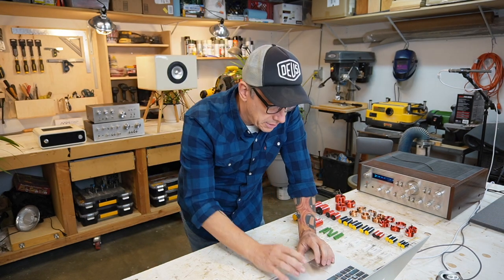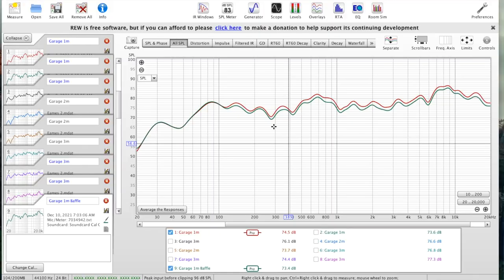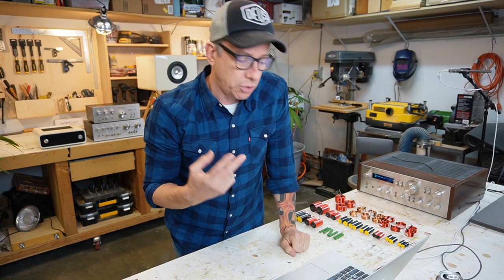We got our first curve. We lowered everything after like 100 hertz. I don't want it that low. I want it to start working here. This is the problem, and this is the problem, okay? Mids at around 500 to 1 kilohertz, and from 6K to 12K. So that's our problem. We might have to work with two notch filters.